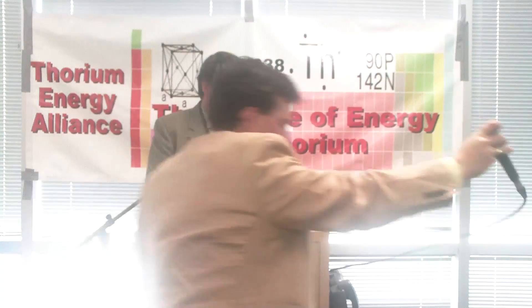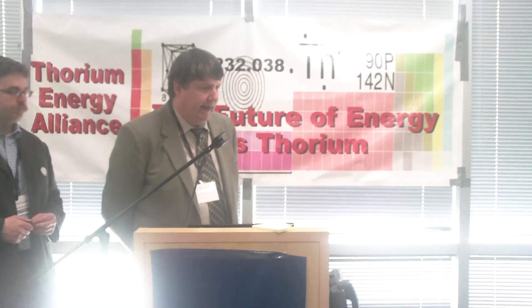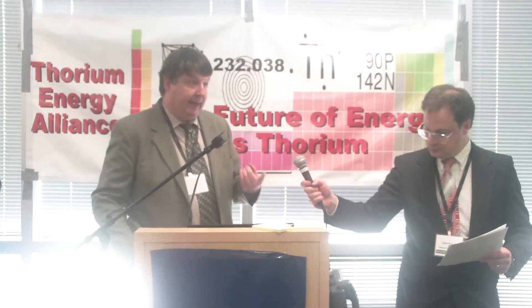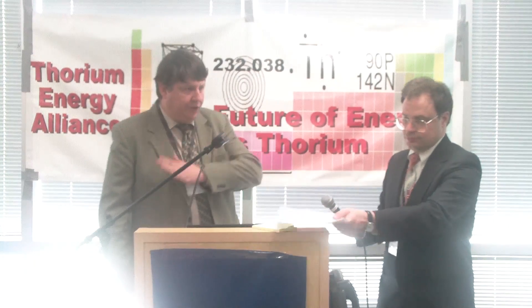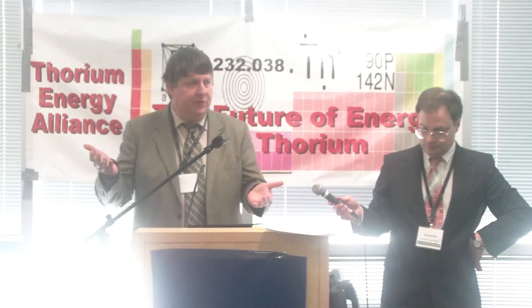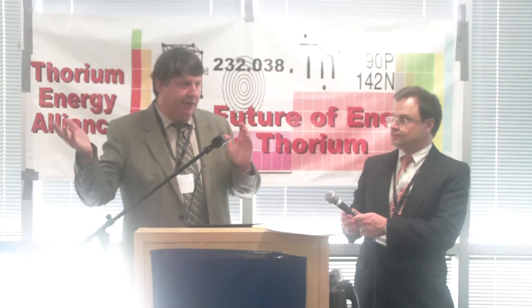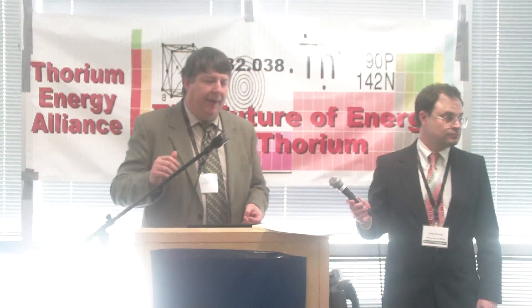Question: At the end of 20 or 30 years, do you reprocess with a plant you build on site, or do you move the salt somewhere else? I would say removing the uranium and recycling — that's the big thing economically, you want to do it. All the transuranics, that's just for legacy reasons, we don't want them going to waste. There's no rush to do that — we can let the salts cool down a lot longer. The uranium we probably want to do fairly quickly. We can either send it off to a central facility. It's only low-enriched uranium, it's not really a proliferation concern. I preferred the idea of maybe just temporarily bringing in fluorination equipment, possibly with inspectors.